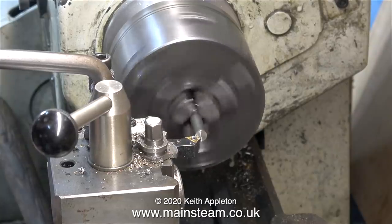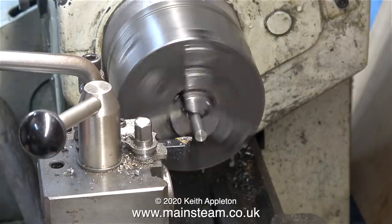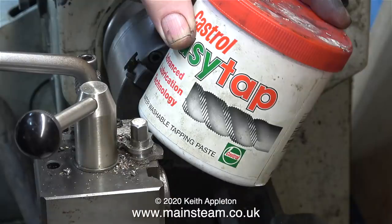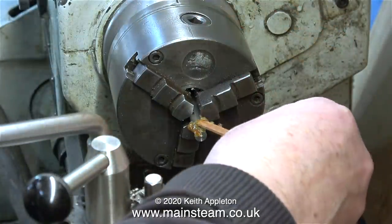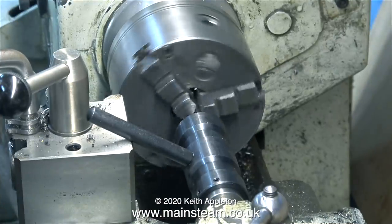I'm very pleased to announce that my lathe is working perfectly again - no slipping of the belts and the three phase converter is working to perfection. It's threading time. I'm using some of this - it's called Castrol Easy Tap - this is an extreme lubricant that helps the cutting of threads in metal. I want a nice clean thread on this part so I'm putting plenty on.